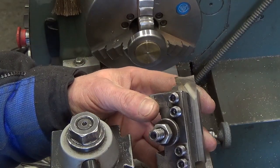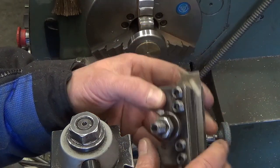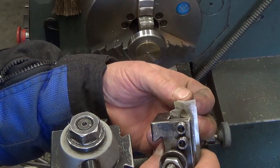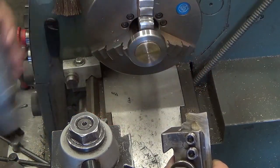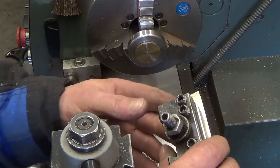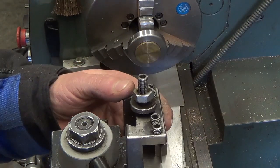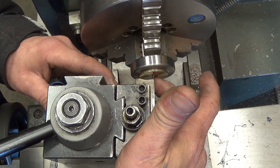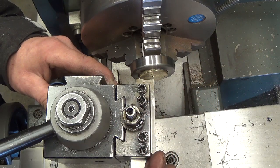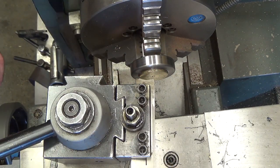To do the center section I'm going to use a piece of high speed steel — it's actually a cobalt planer blade I came across somewhere along the line. I ground a small radius into this end of it; I picked a stone that's pretty close to the diameter of the part we want to put a radius on, and gave it a bit of relief at the bottom. I'll probably wind up having to adjust it a little to get a nice even dome. I'll align the inside edge as close as we can to center and adjust with the cross-feed. I think I have enough clearance on the back so we're not going to hit the stainless.